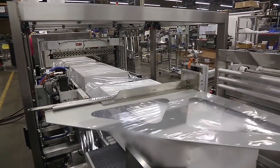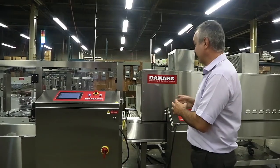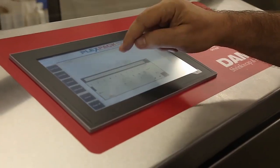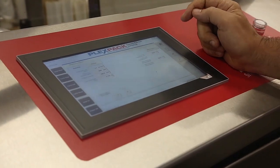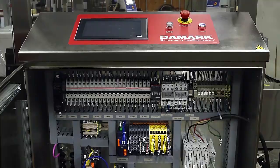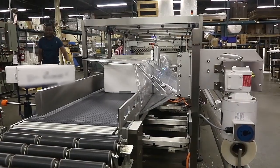We customized a couple of things. Here is the equipment, which consists of two separate machines: the side sealer and the shrink tunnel. They were looking to automate their packaging process. Daymark InstaWrap is using a combo PLC HMI. We have a recipe manual where each separate package can have its own recipe and its own sealing parameters. At this stage the package is fed into our input conveyor so the package gets wrapped into the polyolefin film. They want to conserve the image of the product as best as they can, so the best idea was to wrap these boxes in plastic.